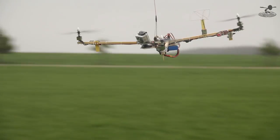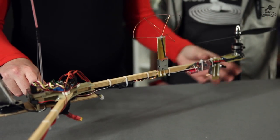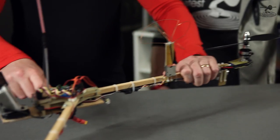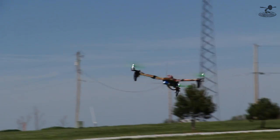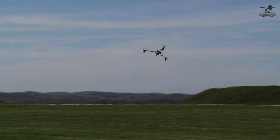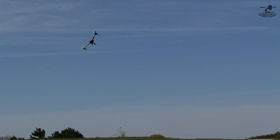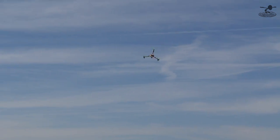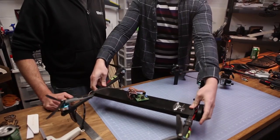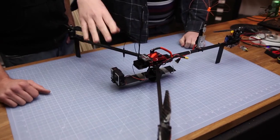Yeah, indeed. And one of the things that makes a Tricopter different than any other flying platform is the fact that it has a servo-driven, like, thrust vectoring yaw, where most other copters are done completely by torque. Yeah, and when we talk about torque, that's actually where it's spooling up motors or down motors to actually allow it to yaw. Now, the benefit from that is when you have a servo actuating this, you get a very aggressive yaw. And it's very consistent. And with the 3 points of the motors being there, it's almost a swoopiness to it. Sure. And a matter of fact, we did a whole Q&A we can link down below where we actually talked about quadcopters versus tricopters. Mm-hmm. The debate goes on and on which one you prefer, but they are different. I think it's a Chevy Ford or an Apple PC debate.